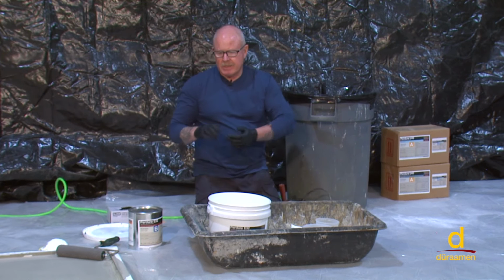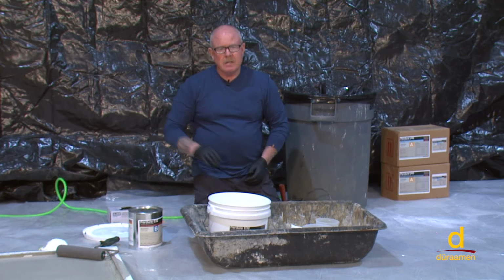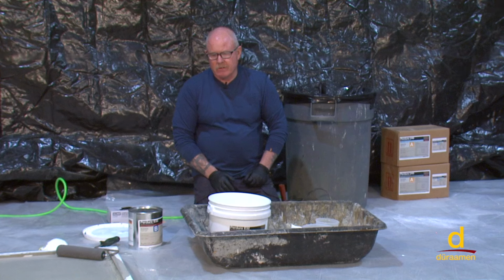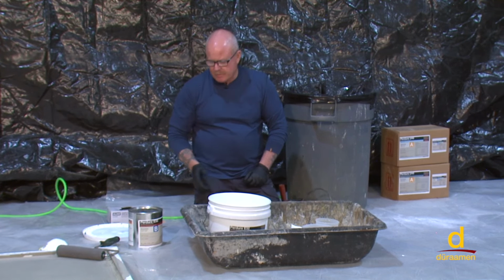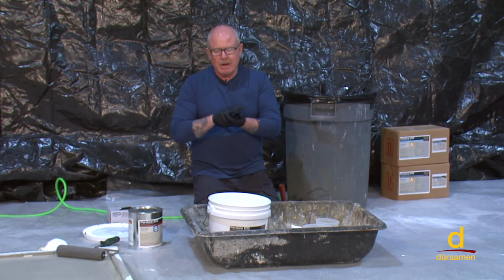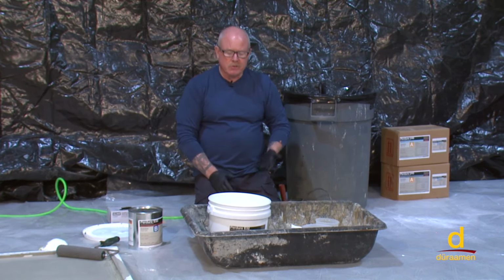The logic is basically we're going to want all the moisture to flash out of the system and leave the film. If you apply it where there's still moisture within the A03 or it's too soon, and then we come back over the top of it with our E32 water-based epoxy, there's a chance that it could trap moisture and blush out or have the epoxy stay white or turn white.